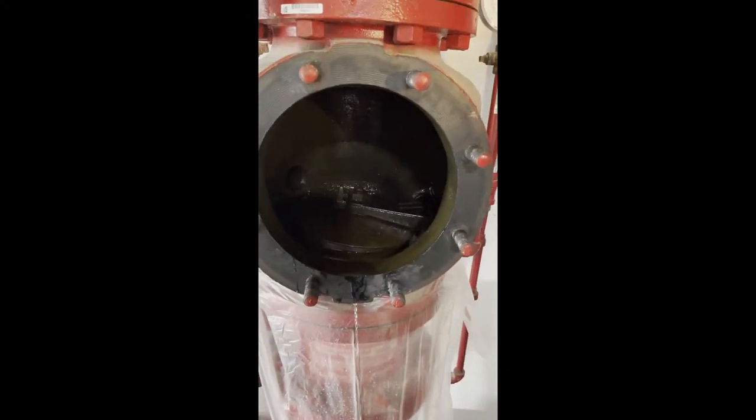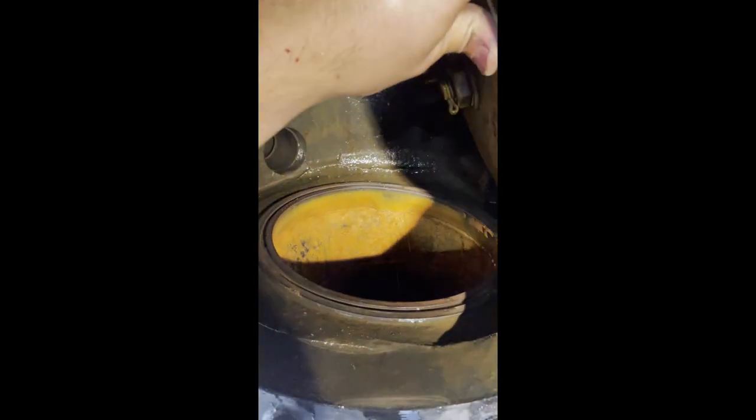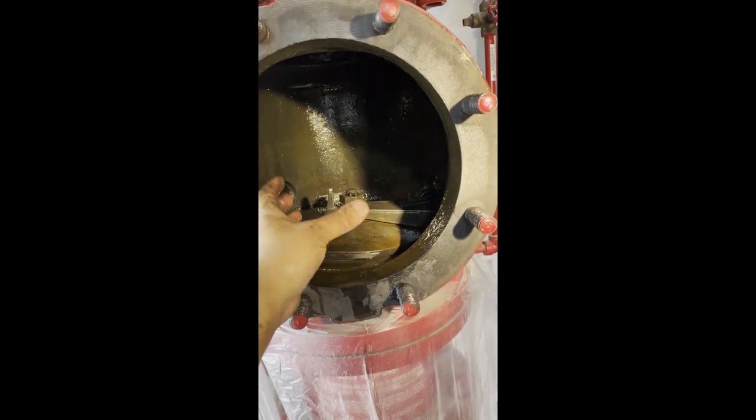The best way I can explain where that intermediate chamber port goes: while this clapper is open, you can see a ring — a little slit in that little brass circle. That ring leads into an internal chamber, which leads to that back port. The clapper just has a rubber gasket on it, and while this clapper is closed, it is covering up that ring, so it is sealed up — whether there's water on the supply side or the system side, that ring is still sealing up the intermediate chamber port.